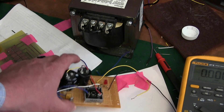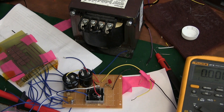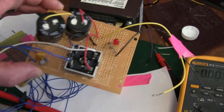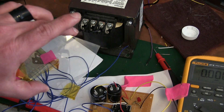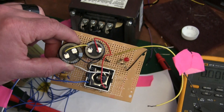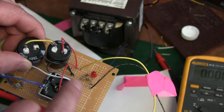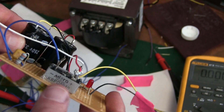The cynical amongst us will no doubt agree that this was an unmitigated disaster — it does not chooch. Fail, total fail. However, it's not a total fail insofar as we learned something, and I learned it the hard way. When it's the hard way, it sticks with you. This needs to be absolutely conductive — it cannot just be static dissipative. This guy, though, works great: a simple little rectifier. We've got a current limiting resistor, a poly fuse, an indicator light, a bleed-down resistor, and two caps in series front to back in order to get the voltage that we need.